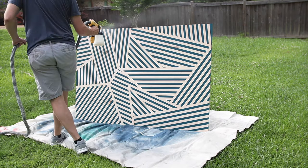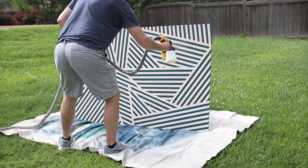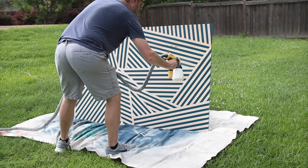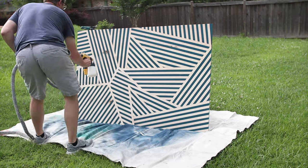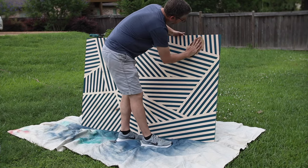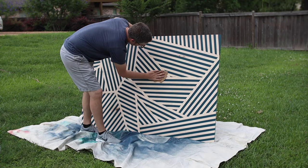There are a few more things still to do to this headboard, like trim it to size and do an edge treatment. Because of that, I wanted to protect the paint and do a seal coat on top. I used the same Flexio sprayer for that — it's a water-based polyurethane and I did two decent coats on there, using a brown paper bag to smooth it down in between coats.